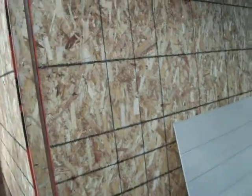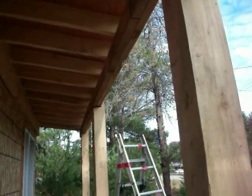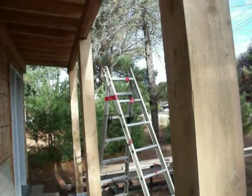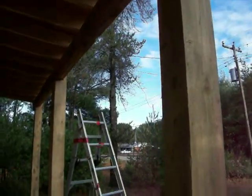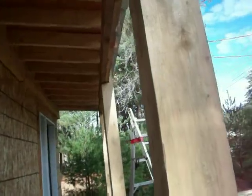Yesterday in the rain — we've had four days of steady rain, so I haven't got much done. Yesterday in the rain I tweaked up this beam up here. It had a bow to the beam and I didn't like it. So I loosened that center post, moved it in an inch, which allowed me to close the two pieces of beam together. And then I put in five lag bolts on either side of this post, and hopefully that's more than enough to keep this beam from separating.